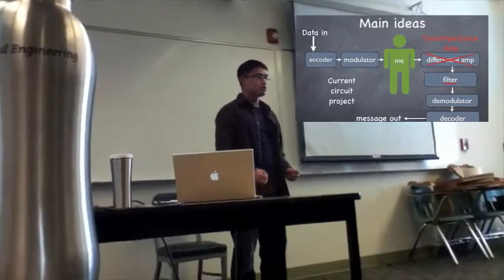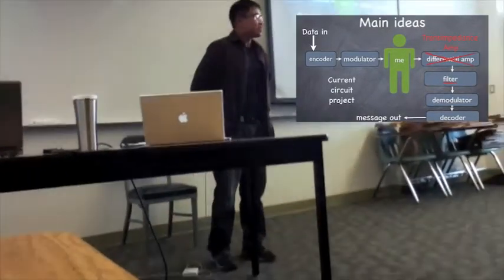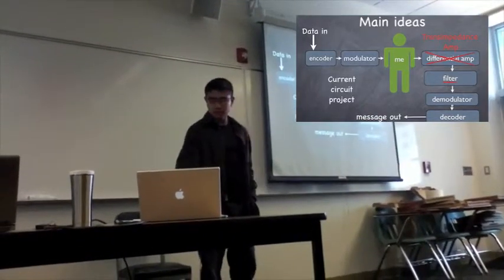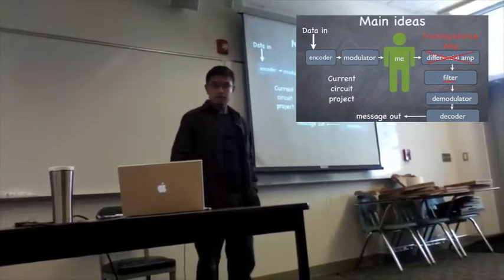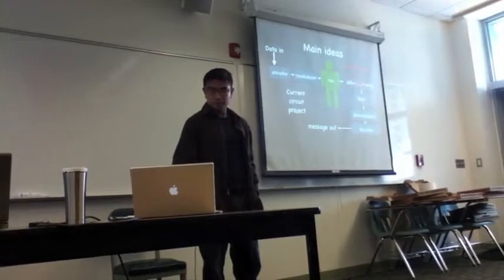As what you're using to read like a heartbeat. That was a mistake. You can't really use that. I have to use a transimpedance amplifier to measure current coming out of it. What I didn't expect to be tricky was the filter design. And this is where a lot of the magic happens.